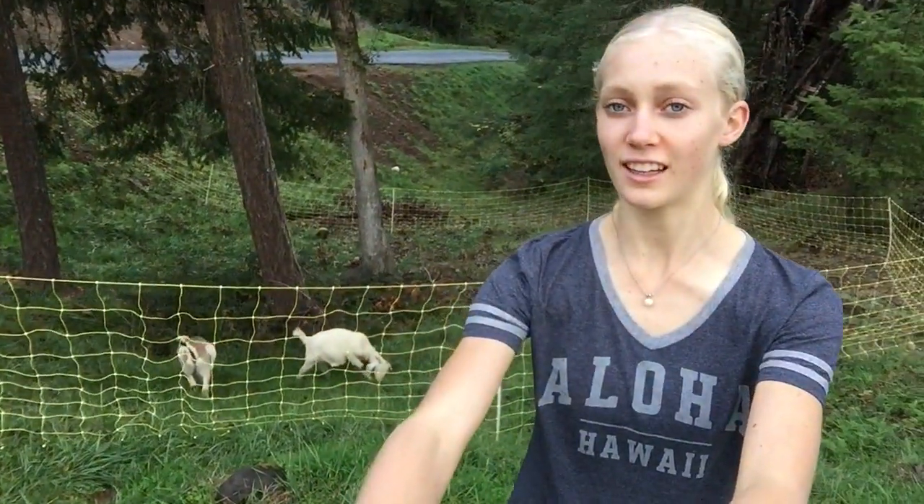I'm back. As you can see behind me, I have Kalaiki and Primrose back there - I have had some success with the electric fence. I have my three ground rods all hooked up and hooked together and everything plugged in - the electric fence is on and the electric current is working. So I decided to put Kalaiki and Primrose in to test it out. I was not getting enough voltage with my one ground rod, so I tried three and got them all connected together. The reader was still saying 1,000 volts and I need to get to at least 2,000 volts.